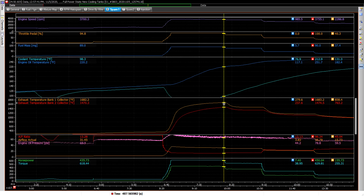I want to keep that at 1650. I've had it go to well over 1900 before for a short time, so I know nothing's going to blow up, but I prefer to keep it at 1650 — that seems to be where everybody says set your maximum temperature. So that was my decision to back it off there. I basically dropped it to 80% throttle, fuel goes to 77 milligrams. Right away, those turbine inlet temperatures just drop down to a manageable level — 1470 — and it pretty much stabilizes there. It just doesn't go up or down. That's where it's happy to be.